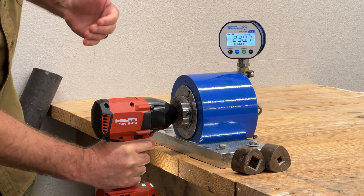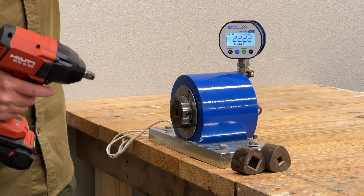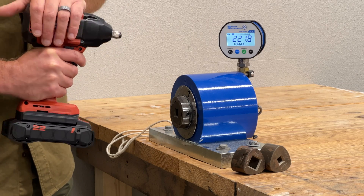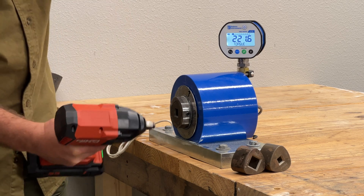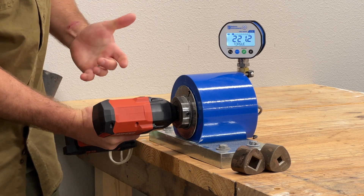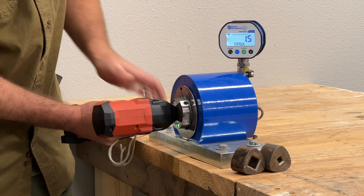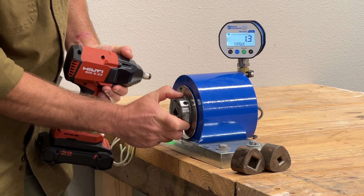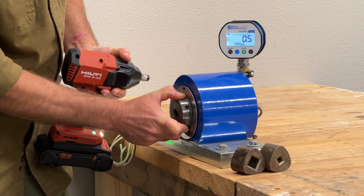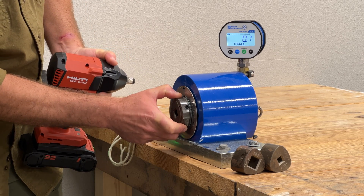In this mode, we topped out about 232 foot-pounds of torque on that. I've checked the torque in forward on this one. Now I want to reset this and get it back to zero, so I'm going to put the tool in reverse, give it a few quick bursts, and it's going to slam itself back over there. Once you see that it loosens up, you can just move it back by hand, and we're starting at the zero point there.